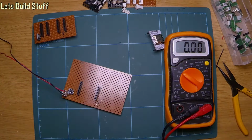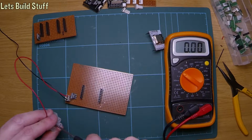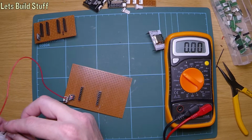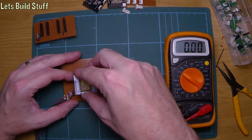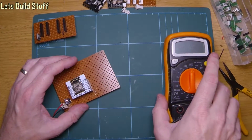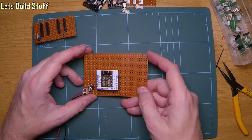Alright. Let's have a go. Put this one back in here. So the first thing is we should actually get that LED coming on the regulator at least. Yeah, there we go. So at least the regulator's still alive. But then I guess it was just shorted out the power, didn't it? Rather than putting it in the wrong way around or anything. So we'll plug that in. Yeah, look, now you've got the blue light. So that's all good. So there you go. Definitely cut the tracks, obviously, because the bottom two is VCC and ground. In fact, that's actually got the flash LED sample code on it.